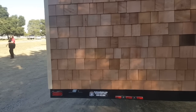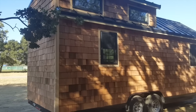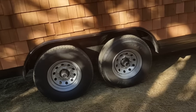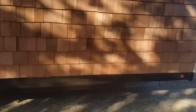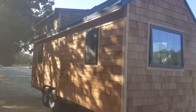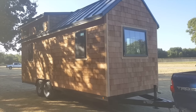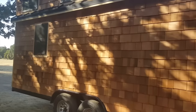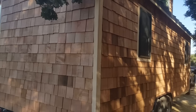Each one gets its own Tiny House Basics bumper stickers. Here's the back side of this shell. This one is built on a 24-foot, 99-inch wide Tiny House Basics trailer with a 10K GVW gross capacity. Each trailer and shell is custom built for the customer, so they can request features like drop axles, extended tongue, different color custom paints, and different widths. All of our shells are built standard on 99-inch wide trailers, but we can go wider over the legal limit or even more narrow.